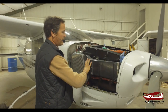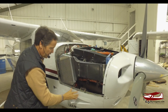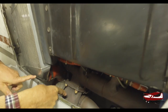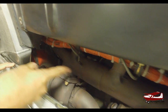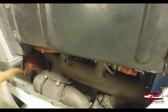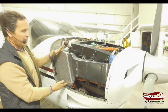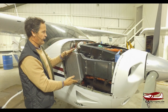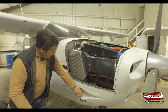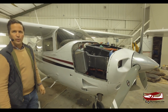So this is the intake. This is the baffling on the engine there. This is all turbocharging and intercooling. Down there is the turbo — it's very big, like in a 206. That's the actual turbo impeller itself. There's the exhaust, and down here is the actual turbine — the exhaust drives this portion, this portion spins and creates induction. This is the intercooler. We're going to do a quick separate video about that because it's a whole subject in itself, but it's a very nice upgrade to have. You can see its air intake here. That's the intercooler — 310 horsepower, TSIO-520.